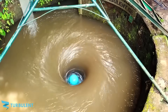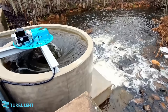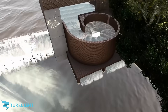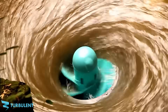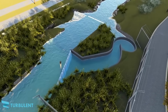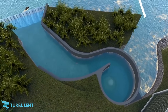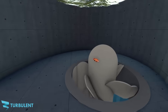This ball is what makes it different from other vortex turbines, like a similar one from the company called Turbulent. The Turbulent turbines are also good for low head applications, but they require quite a lot of infrastructure so that they can generate the initial rotation to get the vortex. The general idea for this construction is that some of the river water is redirected through the vortex. The snail shell design gets it rotating and flowing down into the middle where it creates a low pressure region, which is meant to be fish safe.